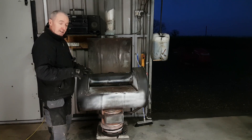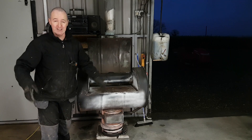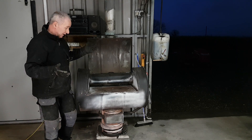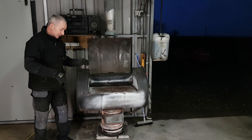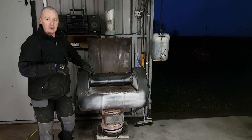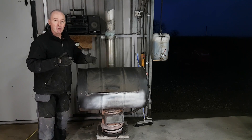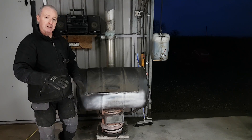In order to test my boiler stove — this Franken stove, which is my main source of heat for the shed — this is brilliant. You can see how hot it's been getting: this was a thousand-degrees-centigrade paint and it just disappeared — ten euro a can, may as well have thrown it in the air. When I designed this stove I wanted to maximize heat output. When the burner is lighting, the flames travel up, hit the bottom and splash sideways left and right, go into these cheek pieces which are about five inches wide, then sideways into my six-inch flue, and up and out. It's single-wall flue as well, so more heat laterally through the flue pipe. I'm only taking this out so I can do my other burner which is currently in production — a waste oil boiler stove. And after this one I have another one in mind, going to re-engineer something already fabricated.